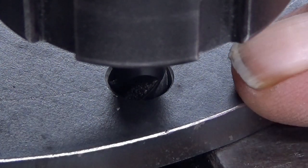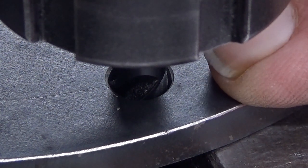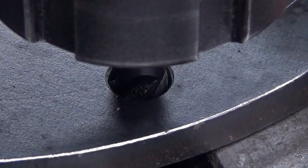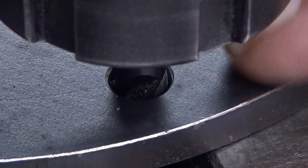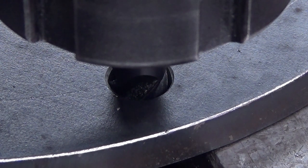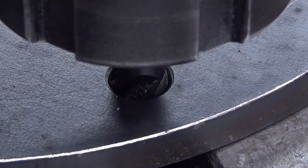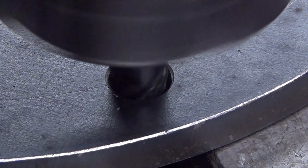So, what I'm doing here is to make these motor attaching holes a little bit oval, so that there is some wiggle room on each and every way here. Maybe only 1 millimeter each side. That should make it a little bit easier, because this needs to be adjusted in place. And I doubt I have done the center compressor mounting holes that accurate that it would really be in the center. But let's see now. Now this is just making these holes a little bit oval, and this is really a very simple milling operation. So let's go.